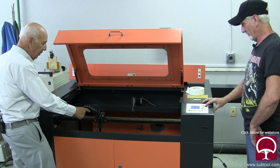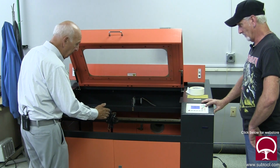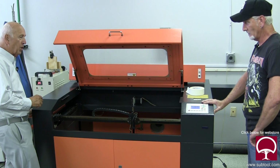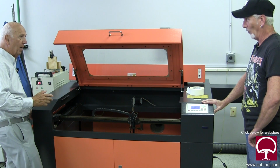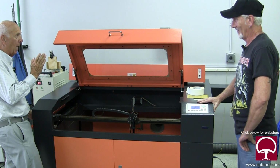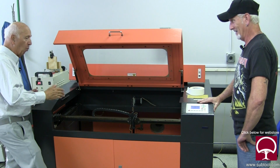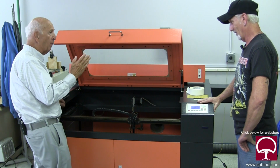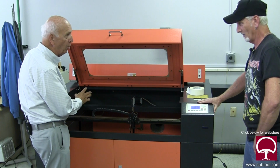And then once you get the beam on this mirror, now is when it becomes really sensitive. So when you get out here, stop right there. If we had to move this, say, a quarter of a turn back here, that's like way too much. Let's think about it as a clock. If you had to move from 12 o'clock to 1 o'clock, maybe you'll get your beam in there, but it's going to be less than that. Once you get way out here, it's like moving a minute or less. So it's like 1 degree or a half a degree. It's like hairs. You're splitting hairs. If you snap it with your finger, you're going to lose it.